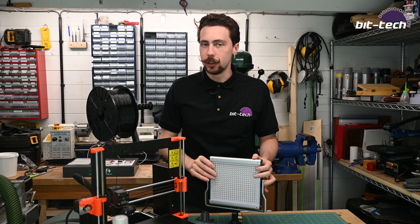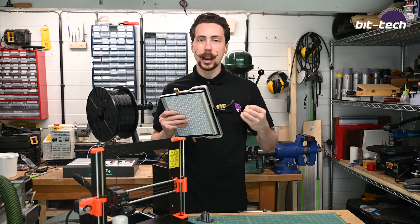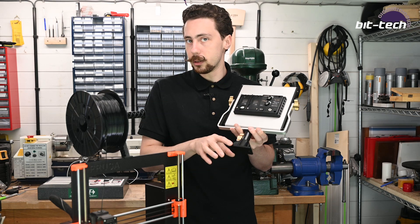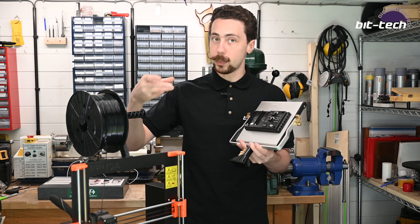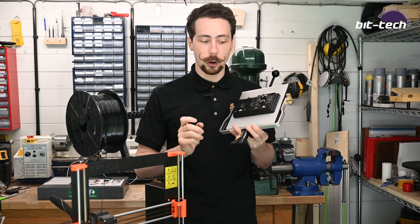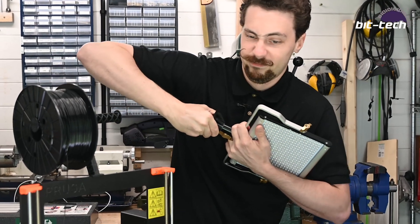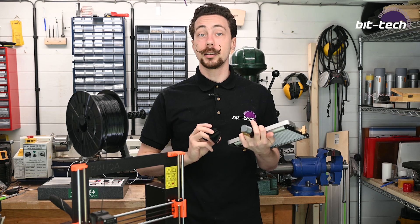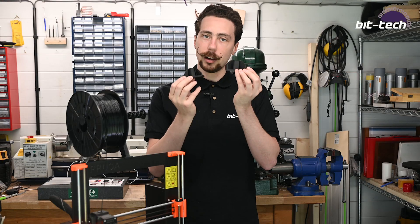As you can imagine, that doesn't sound so good. The reason is that the clip on the inside of this part is just a little bit too big, so it has to expand quite a lot to accommodate the male connector. There's also an inherent problem with this design in that it's round around the outside, which means I'm asking it to flex against its Gaussian curvature, which is just going to cause problems. If you've ever tried picking up a big slice of pizza — if you curve it, it won't bend down very easily. It's the same concept here. The added stiffness might cause it just to break. So that meant going back to the drawing board and coming up with this chunky boy, which is even bigger but a lot more effective.